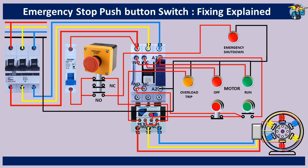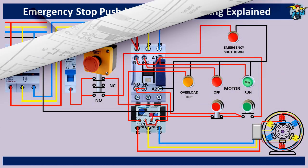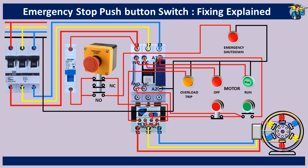Now when you switch on the breakers, the motor stop indicator lamp comes on. To operate the motor, push and let go the start button. The motor runs now with the green indication lamp on. To stop the motor, push and let go the stop button. If the motor is overloaded during operation, it stops and the overload lamp lights.